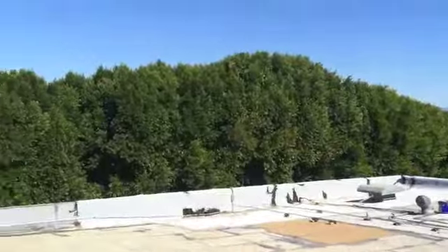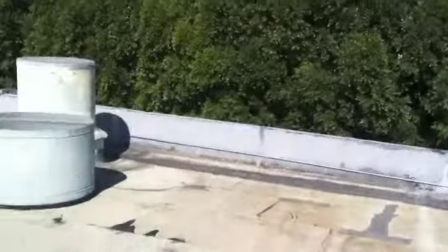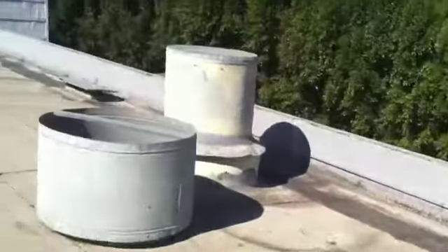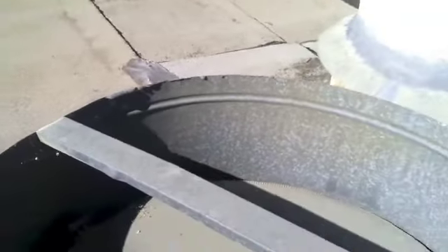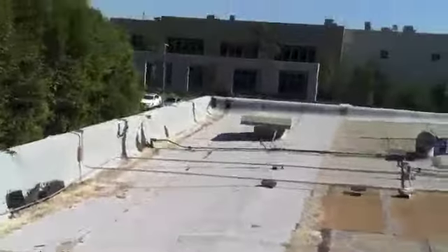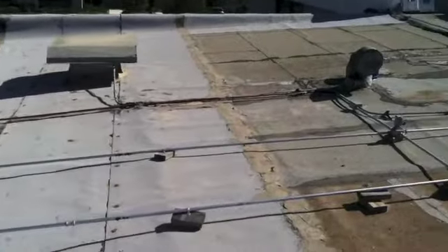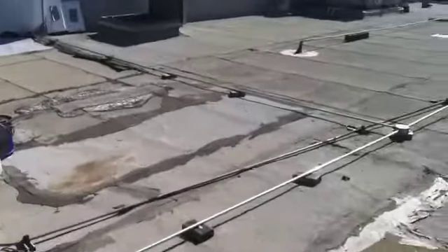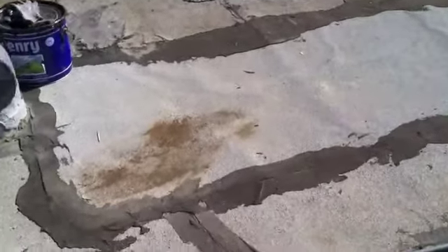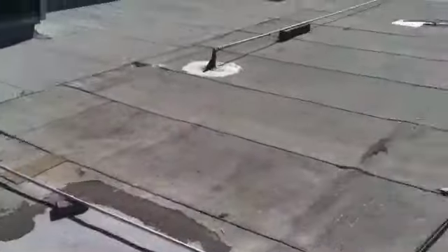Here's a quick analysis on the overall condition of the roof. It's definitely been patched and repaired — you can see the different mastic repairs and patches that have happened over time. This equipment doesn't look like it's being used; probably want to have some abandoned equipment demoed. We've got another patch here, some exposed nails, which isn't necessarily great but has probably done its job for now. I noticed a couple of areas with some pretty serious deck deflection, so there may be some bad wood underneath — not a lot, maybe a sheet or two.